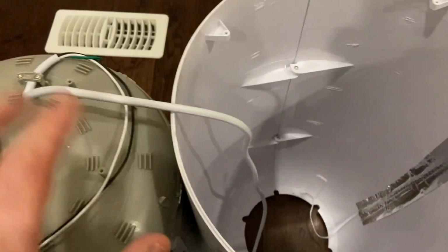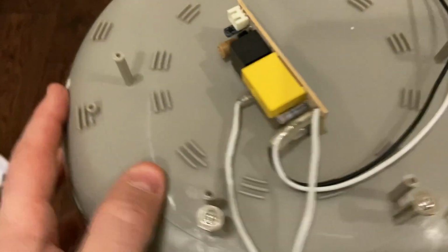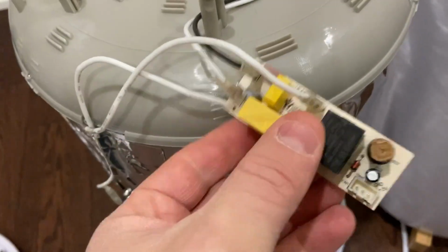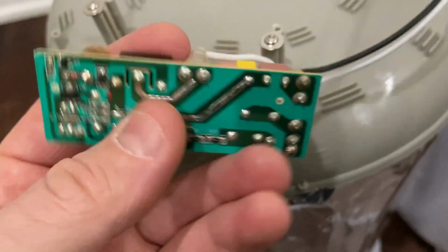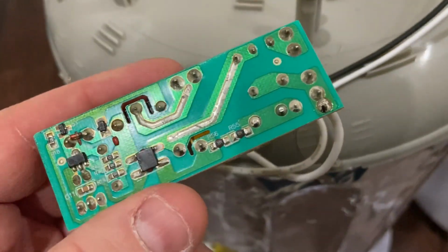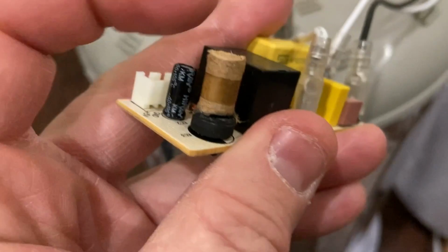All right, folks, so I managed to get the tub out. Apparently it was connected to the controller on this side and the power supply on that side. So as soon as you disconnect it from each side, the whole thing just slides out because it's no longer hanging on. So the cable used to go there, and it connected to the control board here, into that slot. And we have some kind of temperature sense there, and the board is now easy to access, and I can just do whatever I need directly with this connected. I don't have to unconnect anything. And yeah, we're gonna eventually change this cap.